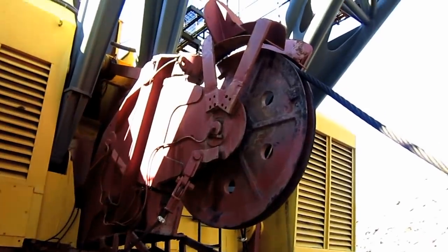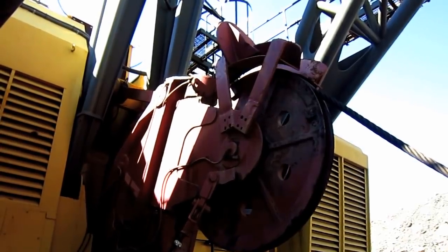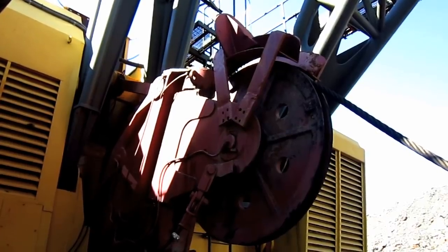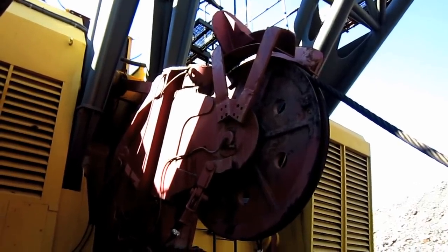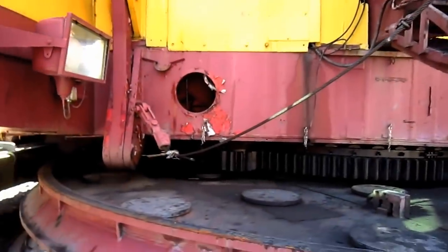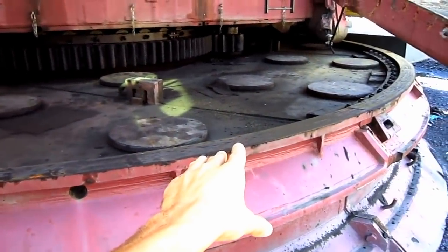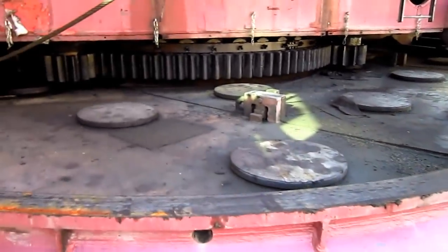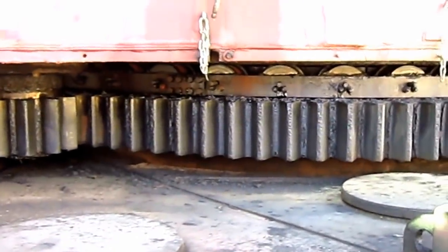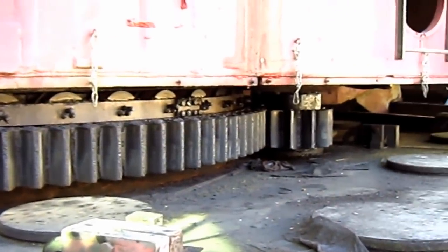The 17-foot 6-inch boom foot on the 380W's boom gives maximum stability for operation. The 380W features an over-under fairlead system, which not only helps remove dirt before it enters the machinery house, but also helps extend drag rope life. Right here you can see the tub on the drag line, which measures 30 feet in diameter. And if you look right here, you can see the center ring and all the individual rollers that will swing the drag line left or right when it's in operation.